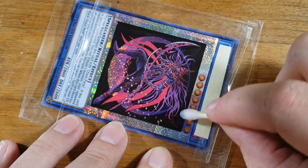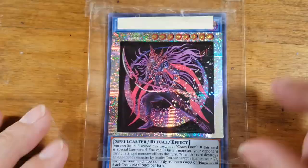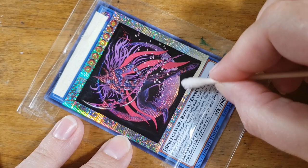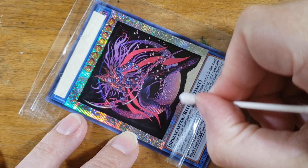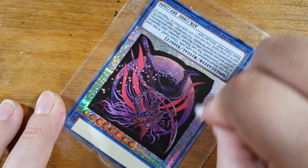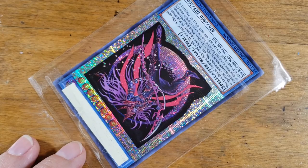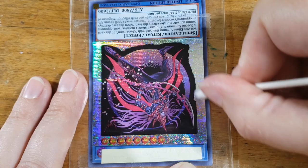Once that's squared away, I can jump in with the acetone. Once you have your card all taped off, the next thing to do is to pull out a bottle of acetone or 100% nail polish remover. I normally find that just in the beauty section of Walmart or Target or whatever your local drugstore is, and you can get a pretty big bottle for just a couple bucks. And a box of q-tips. I recommend the paper q-tips versus the ones with a plastic or wood core, simply because I actually like to cut that tip off to make a more narrow point that'll absorb some acetone to get into more narrow crevices. You'll see me do that later — suddenly the q-tip point is gone and it looks much thinner because I've snipped that head right off and re-dipped it in the acetone to get into those more detailed areas.